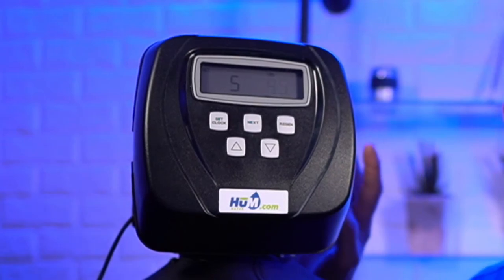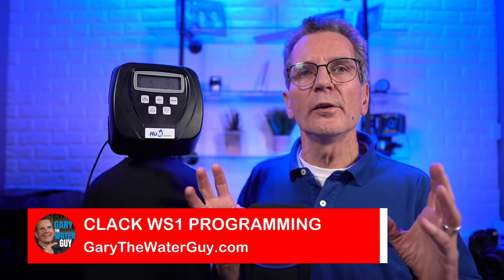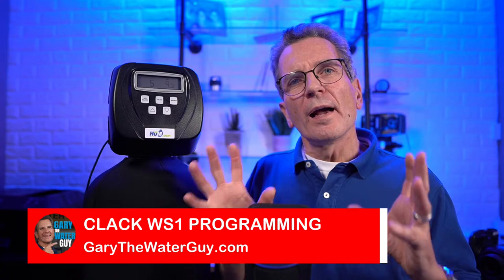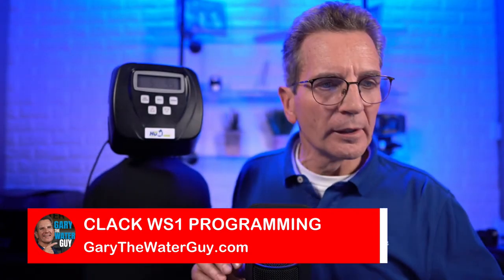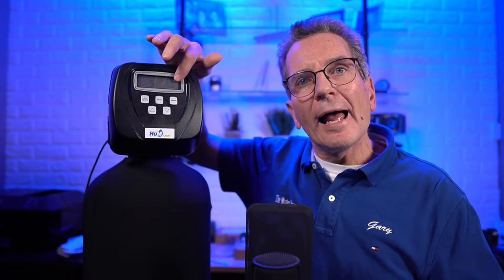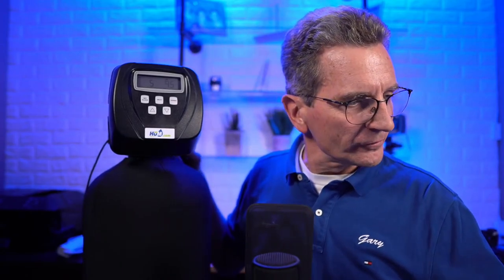And how does it know how many pounds? How does it know how many pounds it's going to use? What happens is a gallon of water will only absorb so much salt. So what it does, it will put so many minutes of water in there, which will equal the amount of water that will consume 9.5 pounds of salt. That's what that setting means. So it's pretty cool stuff.